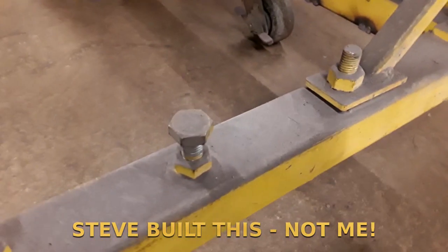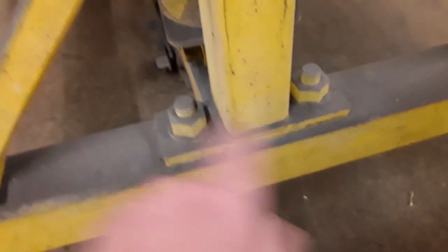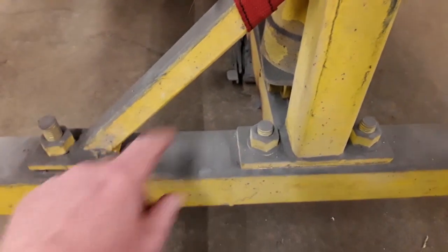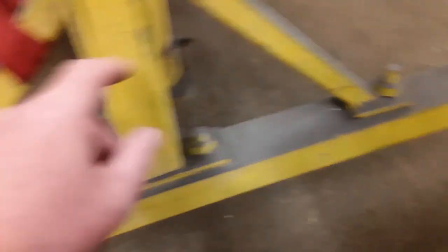The upright is basically two-inch tubing with a bracket welded on the bottom, which is then bolted to the main lower frame rail. You've got two gussets here — those are very necessary. They're one-by-one heavy-wall tubing. This was all bolted to be taken apart for storage; if you have the storage space, you don't need that — you could weld it directly. The bottom rail can be just one piece welded to the upright with two pieces of one-by-one as braces.